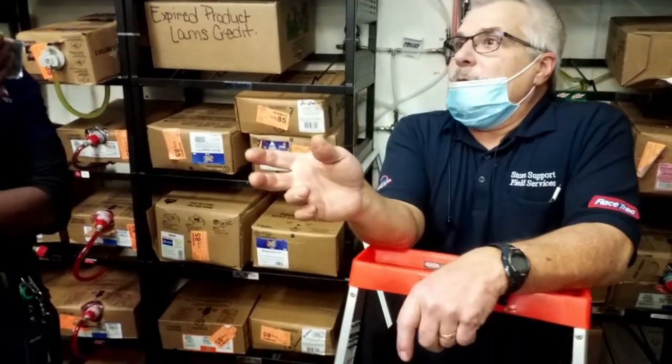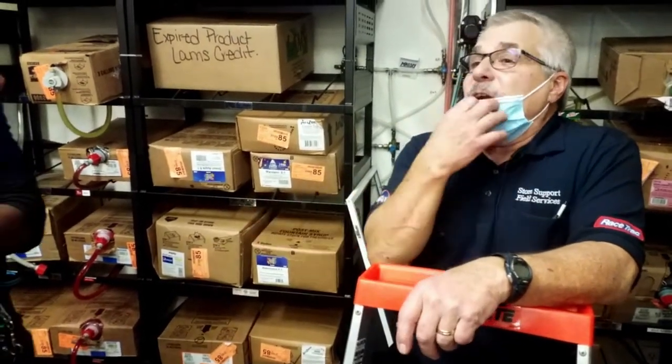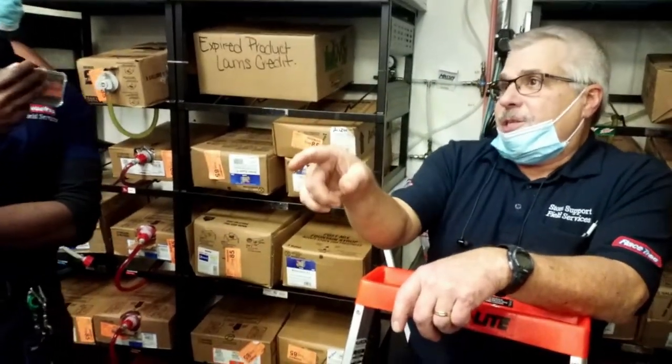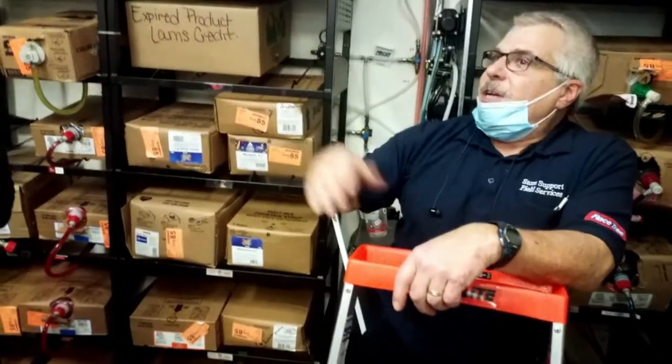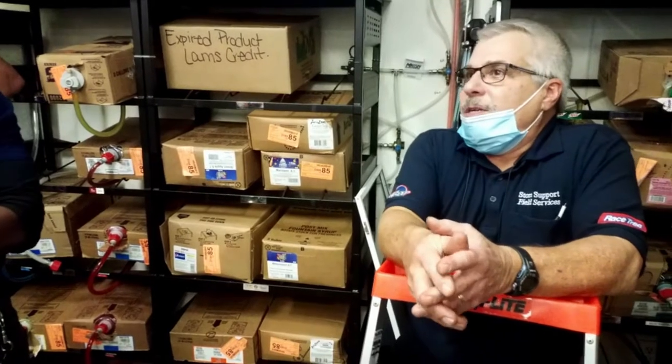What causes this to show H2O when you're coming in? It'll pop in and out of H2O when you're filling. If you're cleaning the face plate and you're trying to fill all of them, they'll go in and out of H2O. Probably because you want to fill one at a time. There's a water booster pump inside the FCB machine that supplies the water pressure to it. If you're trying to fill them all, you're over-drawing what that pump can handle.